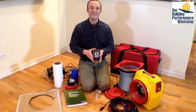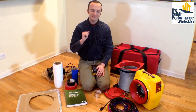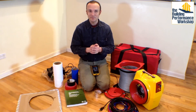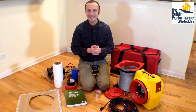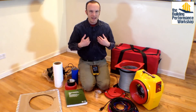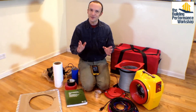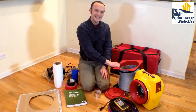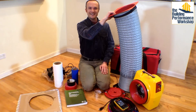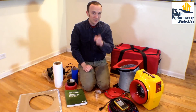The second thing to consider: if I have 16 CFM to pass or less, and I test and it's at 30 — number one, that's still very tight for most systems. Congratulations to the poor installer sitting there crying because he didn't pass and has to pay several hundred dollars to have his test redone after sealing. But also: is it my fault? Is there something wrong with my test equipment? Yes, there probably is. First thing you might notice with a setup like this is your snorkel — this is flex duct. I take this in and out of construction sites all day. It's dusty, there are sharp things. Does this thing have holes in it? Yes, my snorkel has holes in it.